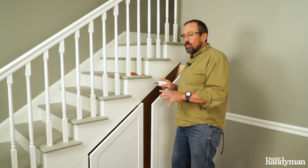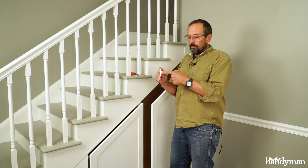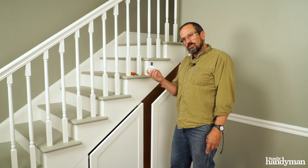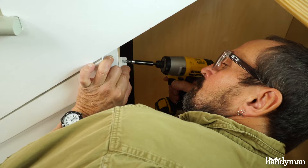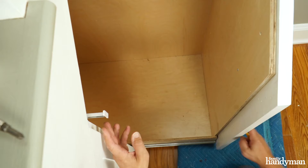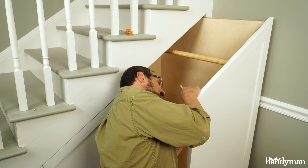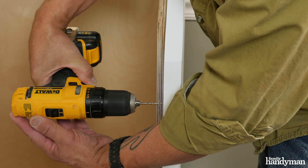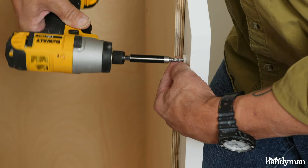I wanted a minimal look on the doors and didn't want to use handles or knobs, so I decided to use push-push latches. Basically you just push the door in and it holds it closed, and when you want to open it you give it a slight push and it pops back open. They're really great to use in a situation like this but a little tricky to install. Set the push latch approximately where it needs to go and put two screws into the adjustable oblong holes. Attach the magnetic plate, and with the latch fully extended carefully push the door into the plate and pull it back. Make some marks and drill two small 3/32-inch holes, then mount the plate.